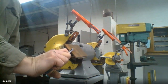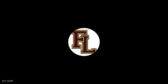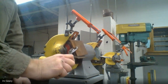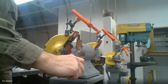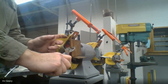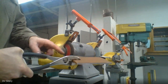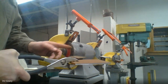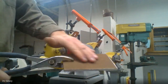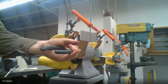It's going to throw it across the room — very violently. So when we're grinding, we want to make sure our part is flat on the tool rest, then grind from the middle down while holding on with the pliers. This part's big enough I probably don't need the pliers, but it's just good practice. If you stick your finger in there it's going to tear your finger up; if you put your pliers in there it's just going to make your pliers shiny — so we don't care about that.